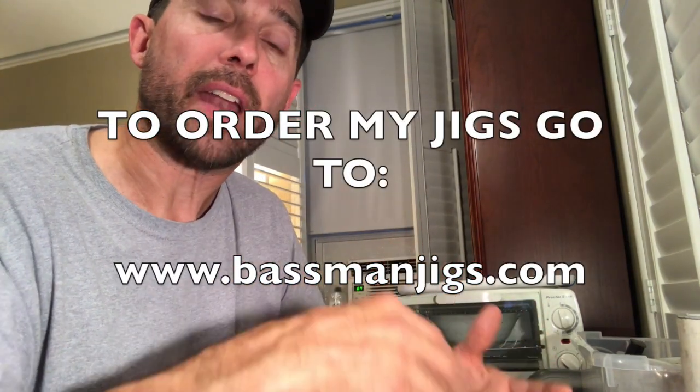The system I used before works beautifully, and it's perfect if you're only making a handful of jigs for yourself, or maybe you and a couple buddies, or you and your kids, or whatever. But I am making them at a higher production rate, so I need something that I don't have to fight with the powder itself. The reason I say fight with the powder is if you're using it just in a container, the powder settles down and it's very difficult to dip the jig heads in. The advantage of using the fluid bed is that air is injected into the material, so it's constantly in movement and it doesn't get settled down in the bottom of the container, making it difficult to dip the jigs in. So it's a much quicker process, and I prefer that, and you'll see that in just a minute.